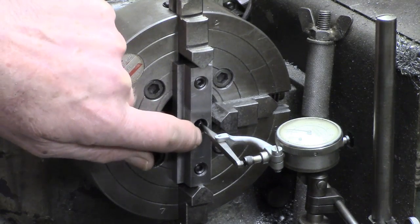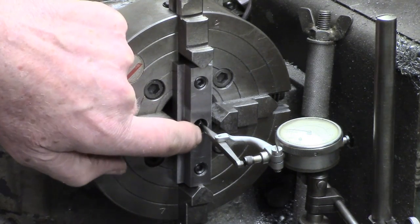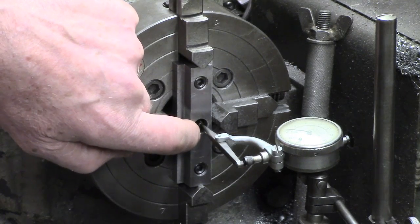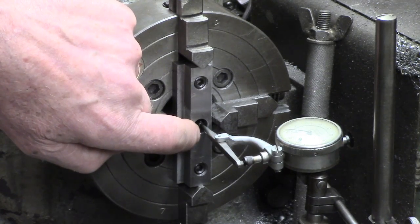This size here is at the moment just under size to take a bearing. So what I'm going to do is put a boring bar in there and increase the diameter to take a bearing, then flip it round and do the other side.